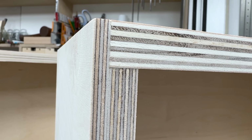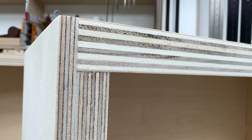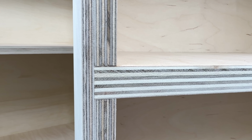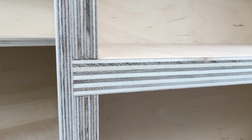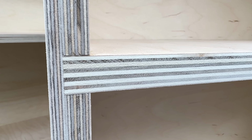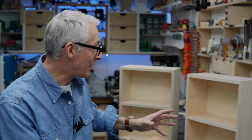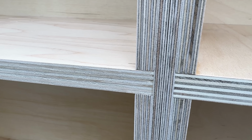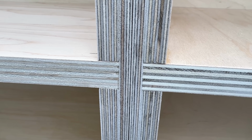So there we are, two simple cabinets with a nicely rebated top and base and the middle shelf in a housing, all made entirely from a little bit of plywood of different thicknesses and all cut with just a tracksaw and a little bit of care and all the measurements taken from the space that's available, and the whole thing just glued together. No fixings needed at all. I don't actually know the dimensions of the cabinets, and I don't even know if they're properly square, but you know what, it doesn't matter because they're made to fit the space I have.